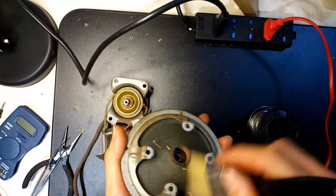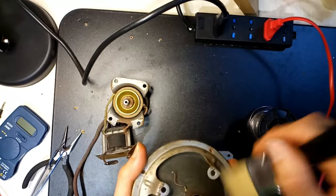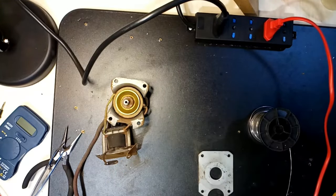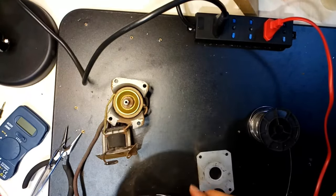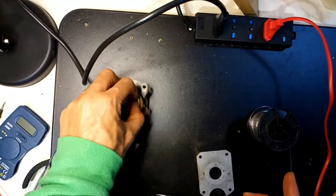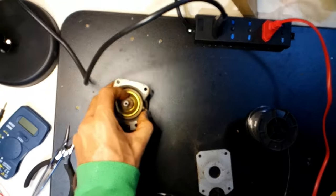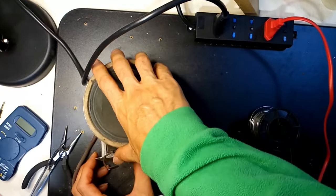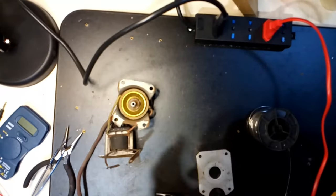The loudspeaker has been laying facing up for decades. While testing the radio, it appears that it has been collecting so much dust that the voice coil cannot move. Opening the loudspeaker becomes necessary to remove all the dust. Unfortunately, there is also rust to take care of to avoid scratching the voice coil while functioning.